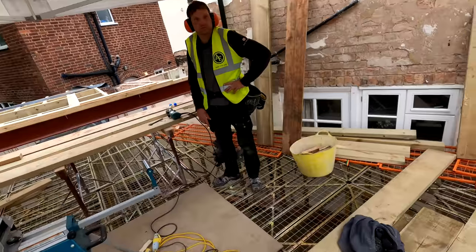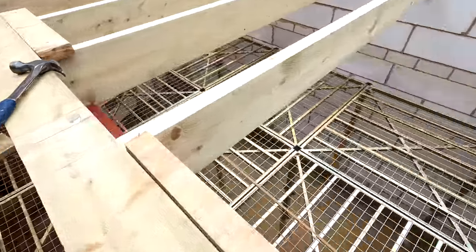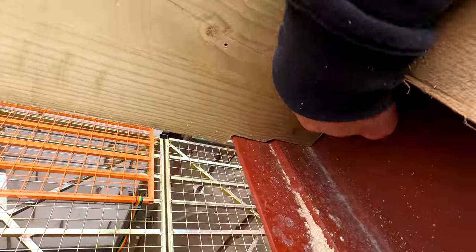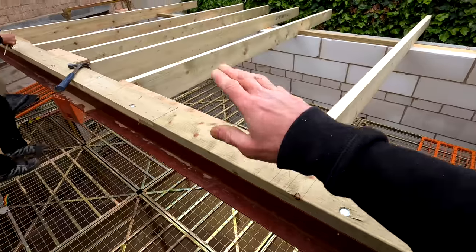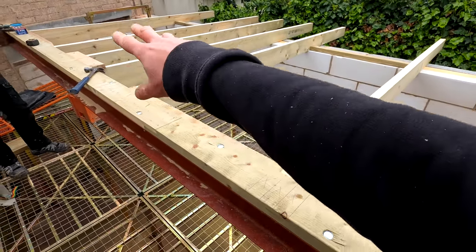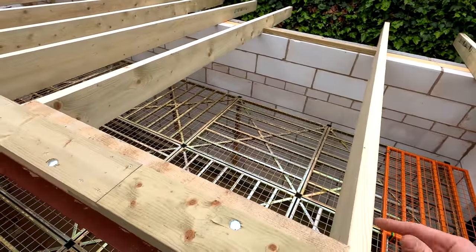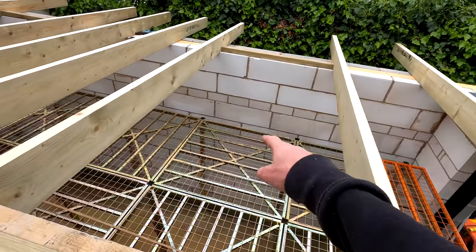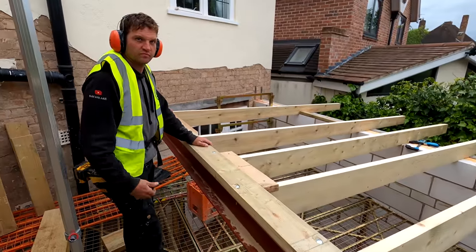Pete's just machining up some more of these rafters over there, because we need this detail to go over the webbing like I've mentioned before and shown you before. So we need obviously a load more timbers to go in here, because we've got triples either side of these windows. It obviously chews up quite a lot of timber in this roof. So while Pete's doing that, I'm going to start getting these trimmers sorted out, get these all marked up and cut, and then yeah, that's it.